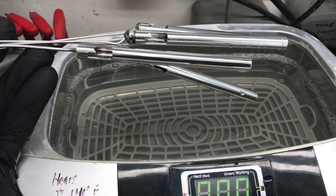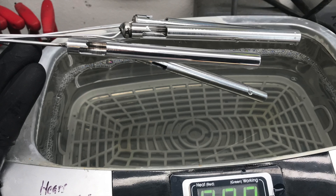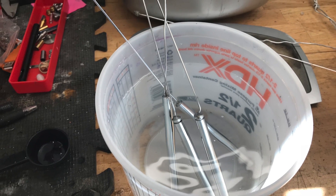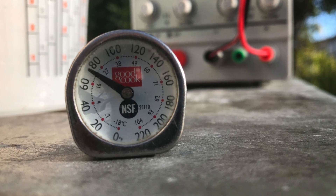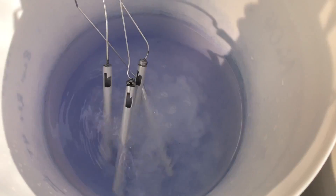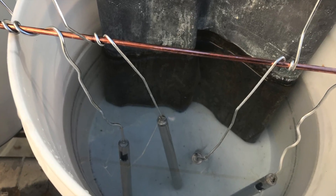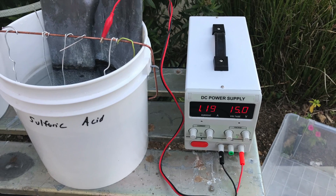After cleaning the aluminum parts in an ultrasonic bath, first I'll rinse them, then I'll hang them in the solution. The temperature is real important — do it at about 70 degrees, plus or minus 5. First I'll etch for about 30 seconds to a minute in the lye — it'll kind of smooth out the surface. Here you can see the parts hung in the acid bath.